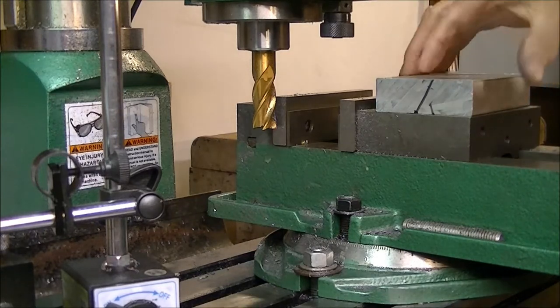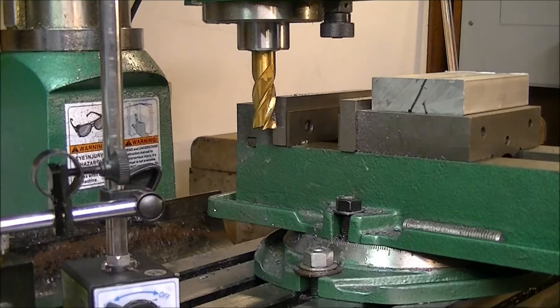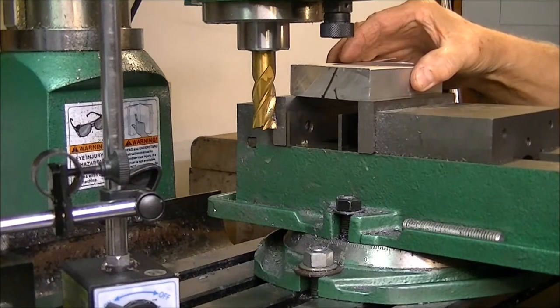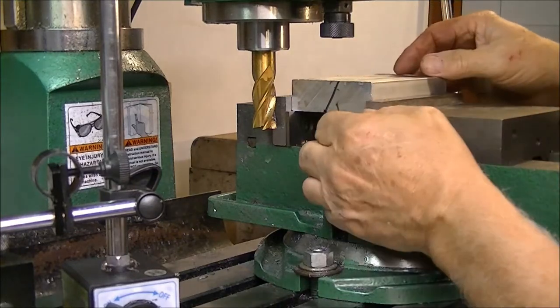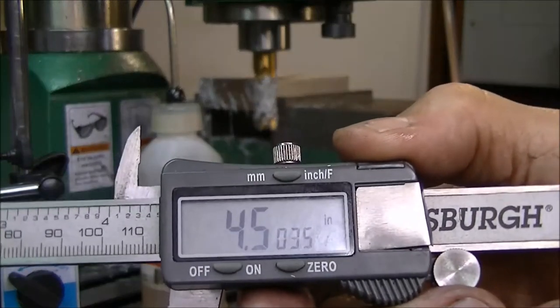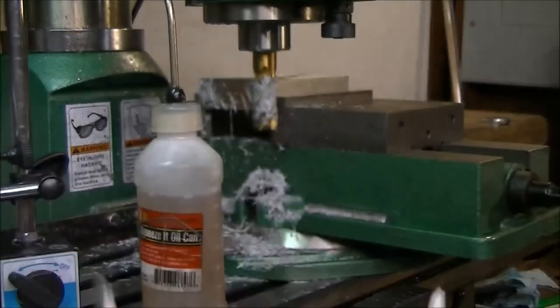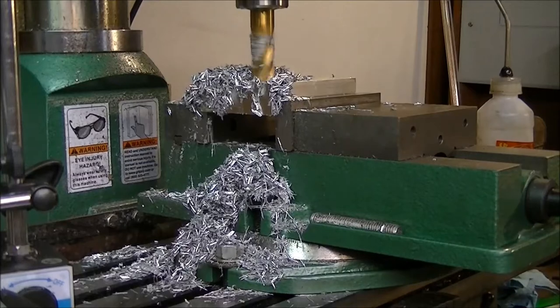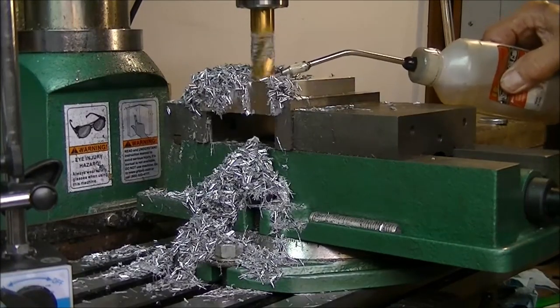Got some nice size parallels in there, and we'll just set this little buzzer up here so I can square it off a little bit. It measures out at about 4.503 in width, which is close enough to 4.50 for me. It certainly clears the wipers on the lathe. So what we'll do now is cut some grooves so that it'll have a two and three quarter inch piece to drop down between the ways, so it won't rock back and forth or go sideways.